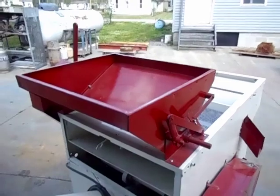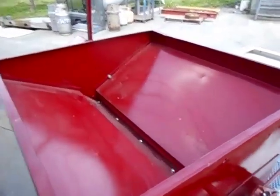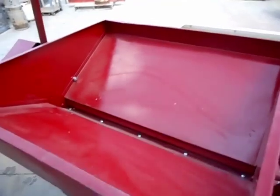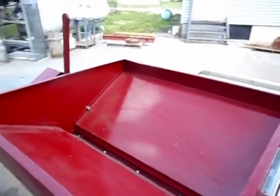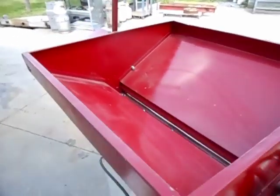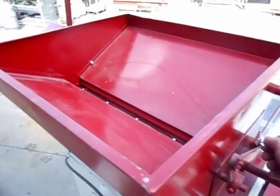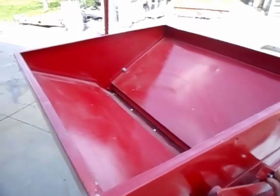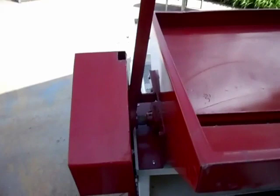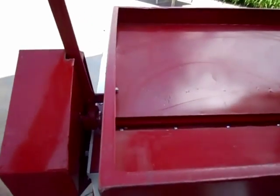This unit has the optional roll feed hopper. It has a six-sided shaft that rotates to meter the grain through the machine. It also has a control gate to open the machine to feed the product, and a disengaging clutch to disengage the roll beater.